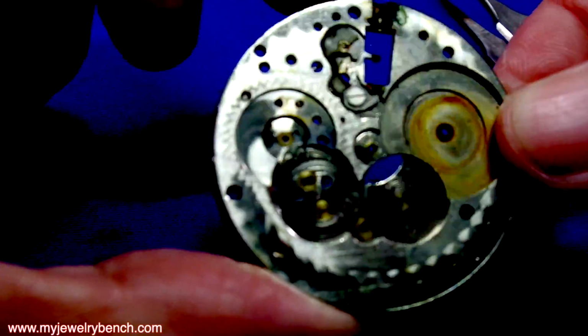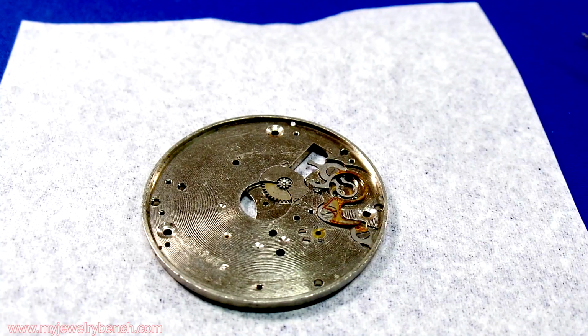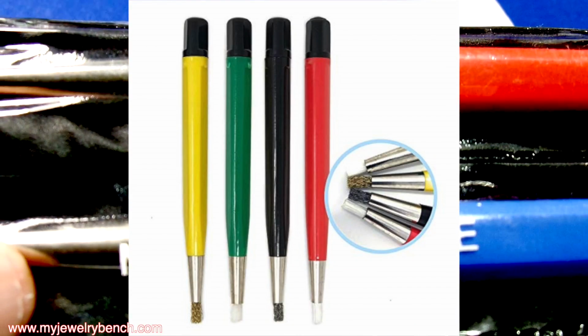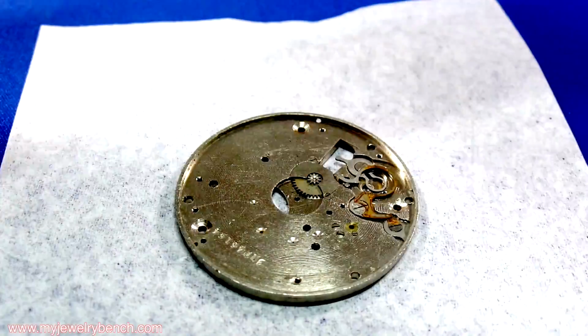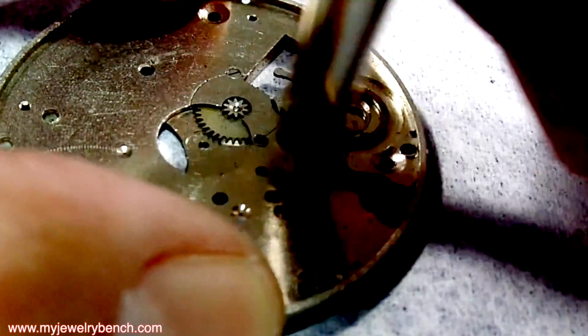So after you get all the parts off the watch, it's time to look at it as a whole, and I'm looking here at the main plate, and I'm going to start by using a fiber brush. You can get these fiber brushes on Amazon. I'll put a link in the description below where you can get these. I use a nylon fiber brush and a fiberglass brush to remove rust. There are some considerations when using either.